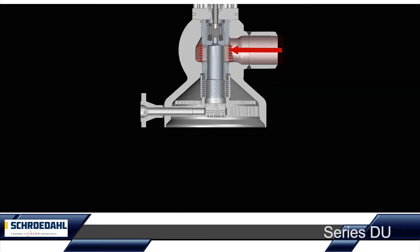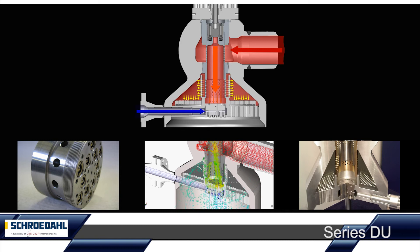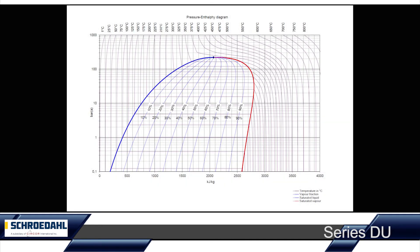The 5-staged pressure reduced main steam flow, shown in this example, passes through the valve via the last fixed pressure reduction stage, and is cooled by the atomised spray water and motive steam mixture. The steam atomisation of the injected spray water provides the perfect steam consistency, near saturation temperature for every system design.